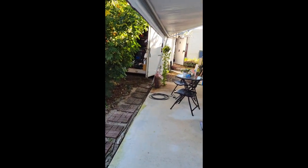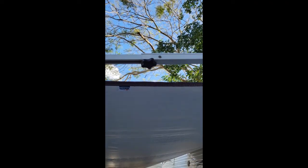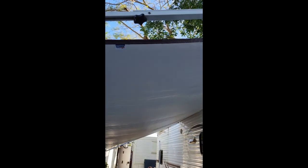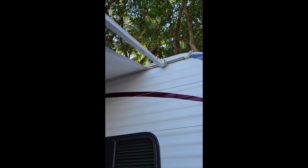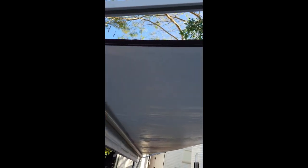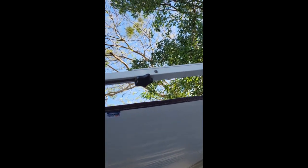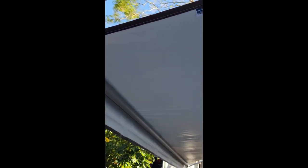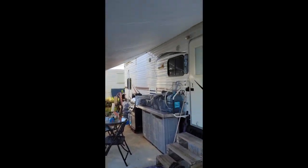Not having to take the whole thing apart and remove it from the building is just great — doing that would be absolutely ridiculous. I lowered that side down to the bottom and didn't even bother the other side. I did, however, take this arm apart, which is just unscrew the thumb knob and the two pieces pull apart, so that this section just laid down. Because up there the awning goes in and comes out underneath, whereas down here it comes in and goes out above. So that's all I took apart right there. The stepladder held it straight up and down, so it wasn't a problem.